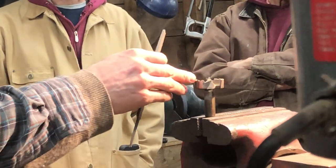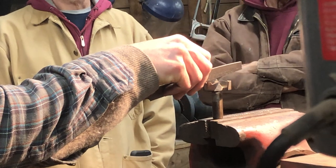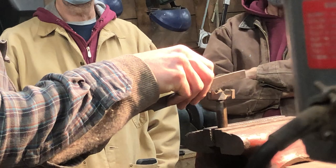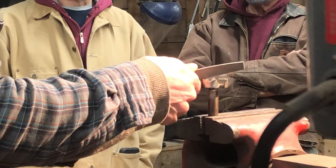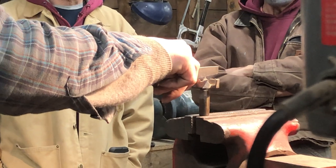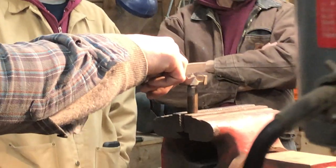If this cutting edge right here is running into the center, that's going to be a 90 degree angle, as the wood is seeing that cutting edge. If I'm filing it this way, then that's just pushing wood out of the way. It's not a cutting edge. If I'm filing it this way, then I'm making a 45 degree cutting edge. Is this making sense, or am I totally losing you guys?